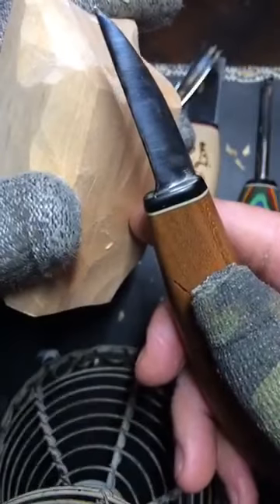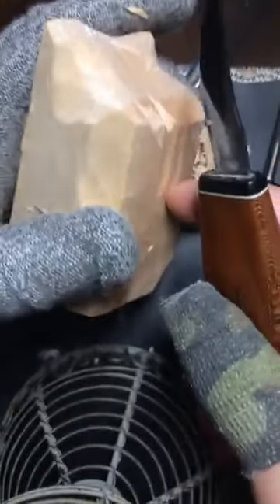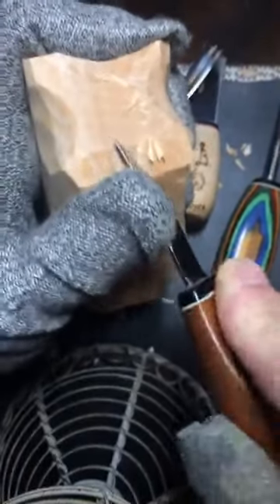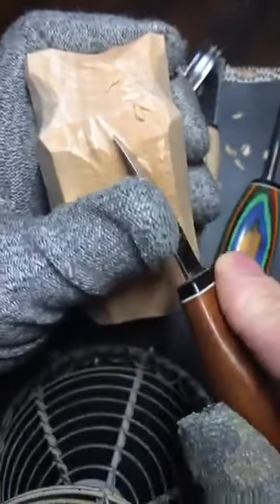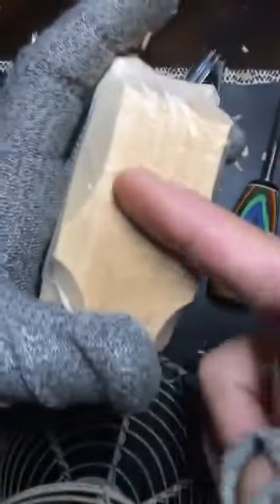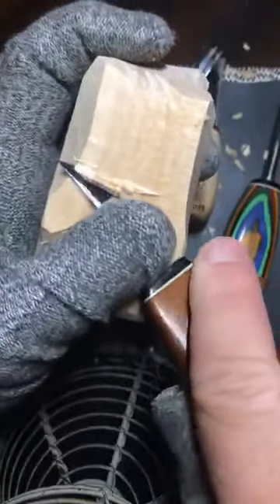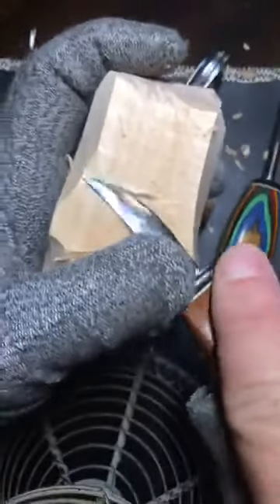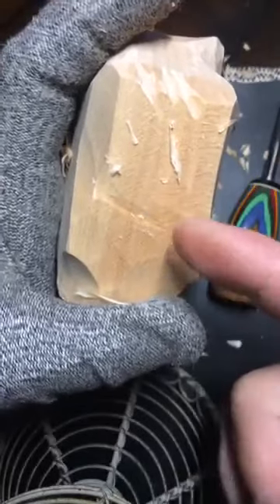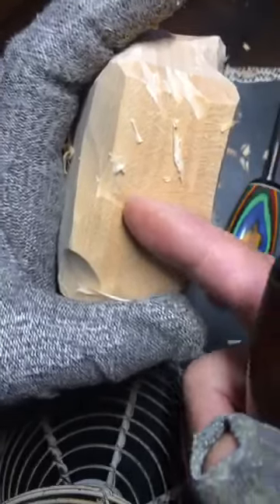So that's what we all start out with — our knife of choice. Same way if you have an upsweep blade, this just so happens to be mine. Same way — it's a push and a twist as you're pushing. And what you do is you create that cut. Now I'm carving on the corner here so I've got a little bit of wood to bite in, but on a flat piece around the back or the spine area, you can do the same thing — pushing and slicing, getting that same action. What you're doing is creating that shadow line in there. Because you're cutting it with a knife, it's not perfect like it would be with a number nine or number eight gouge — it looks more realistic.